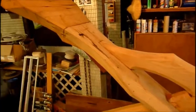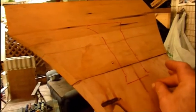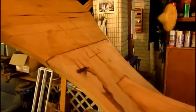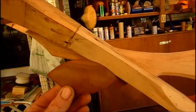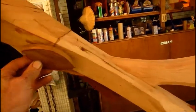Now it's detail time. I'm going to put an asymmetrical dovetail plug here because Hinoki is a softer wood, and all of our stress is right on this joint, so I'm going to make sure that that's strong. In some areas we got some ugliness happening, and I've got a remedy for that — it has to do with plugs that I'm making. The end shape will be more like yin and yang; right now it's just like a cat's eye. I'll embed that in there — it'll beautify it and strengthen it.